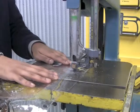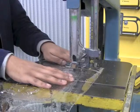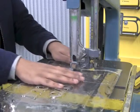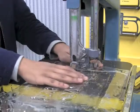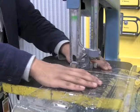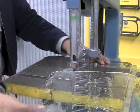Slowly guide the piece along, keeping hands clear of the blade. Push the piece from either end. The three-tooth rule should be followed, where three teeth of the blade should be touching the width of the piece at all times. If this is not possible due to the thinness of the piece, ensure that a slow feed rate is used.